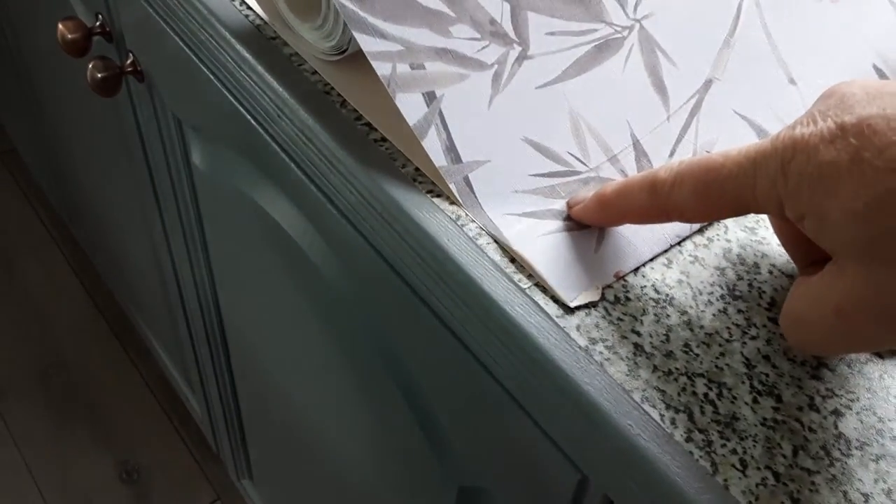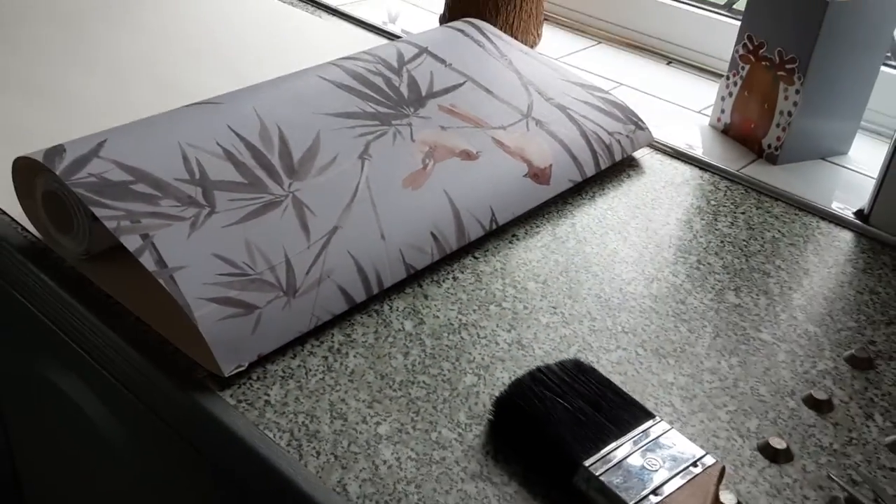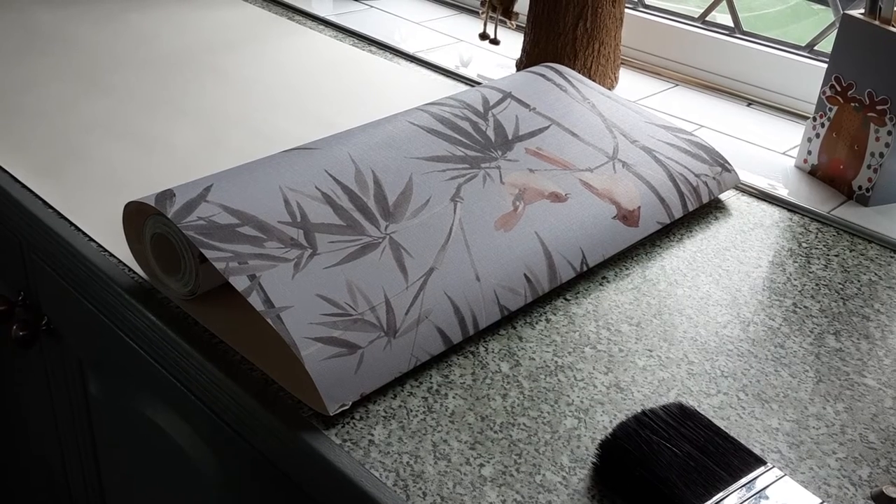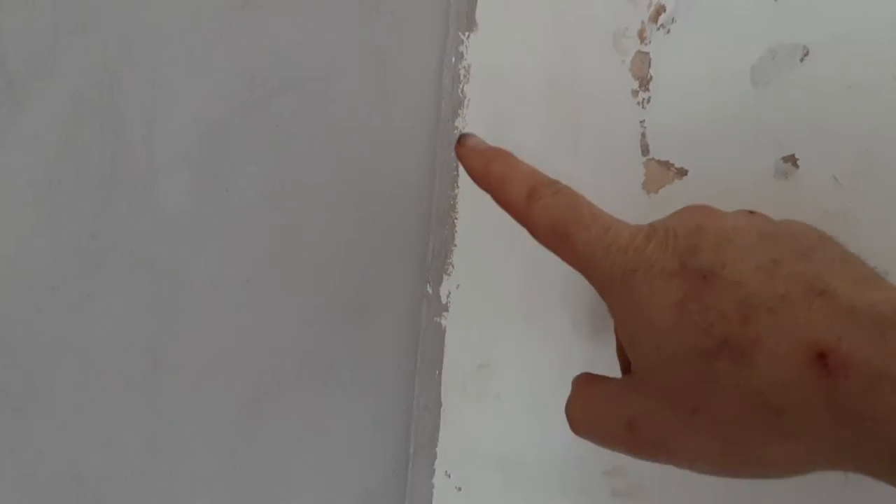So we've marked it at the bottom, squared the paper off, and just rubbed it through — we'll cut that off now and it'll be ready for the next piece. This is where me and Mrs K start falling out. While Mrs K's putting the paste on, I'm going to put the overlap adhesive along there. I measure out the width of the wallpaper and put the border adhesive there so it reaches the joint, because when we first started papering the joints were lifting up. Just make sure you rub the wallpaper down well with a wet cloth to remove any of the border adhesive paste, else it will start shining and stick out like a sore thumb.